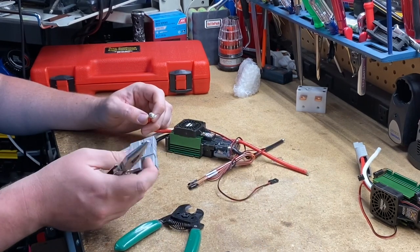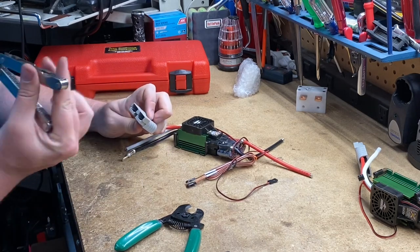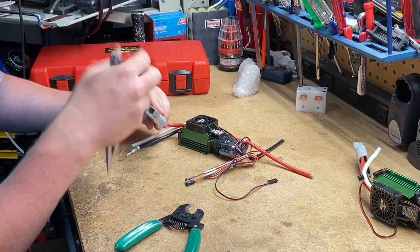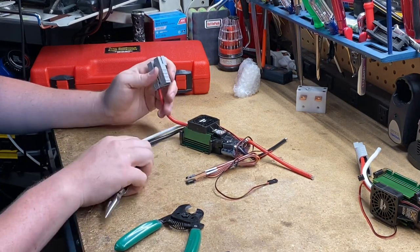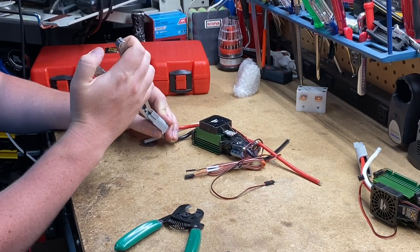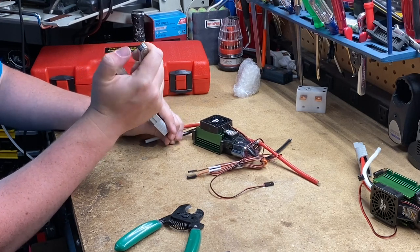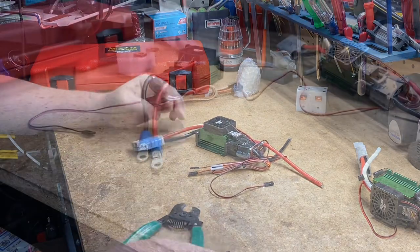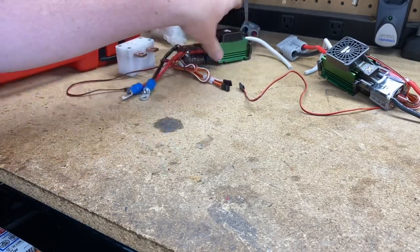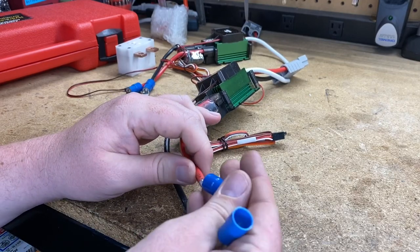Attach the Anderson — this is the positive side. I want to make sure that little nub is facing upwards as I load this in. You're going to need a pair of needle nose pliers to push this tab down to allow that piece through, and that will slide in there. So our next step is to attach these little connectors onto the battery leads, and what I do is sand the outside of this a little bit to make sure it will just drop on.